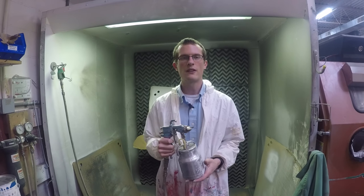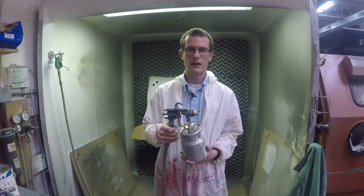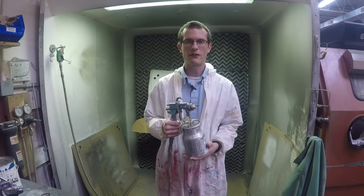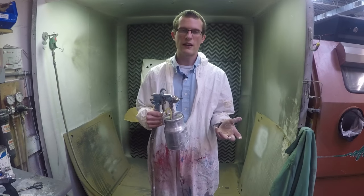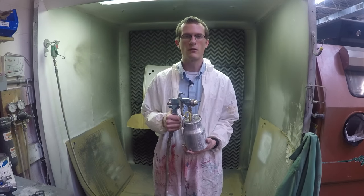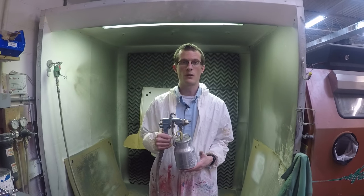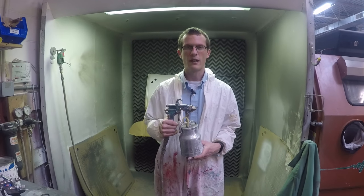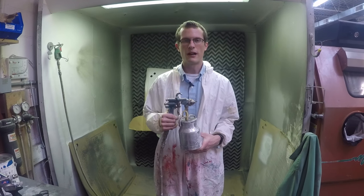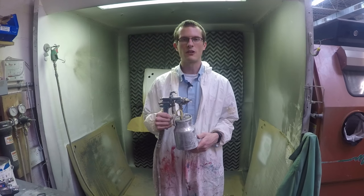Comparatively, to use a compressor, you're looking at a twenty to twenty-five CFM compressor that may be two to three thousand dollars, and then a spray gun, which would be anywhere from three hundred and fifty dollars for a gun like this with a cup and everything. But you can also use a pressure pot. You can get those with the Pro Comp Series turbine sprayers from Graco, but a true two-gallon pressure pot with control of air and fluid pressure at the pot, where you can spray about anything up to an epoxy, a zinc, or anything thicker than that. For thicker materials, you almost always need to consider the compressor or an airless sprayer. But if you're looking for portability and that finer finish, then the turbine could be a great option.